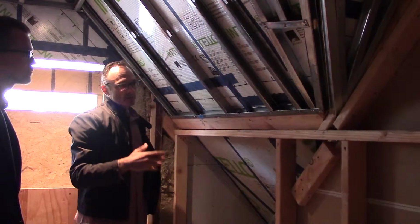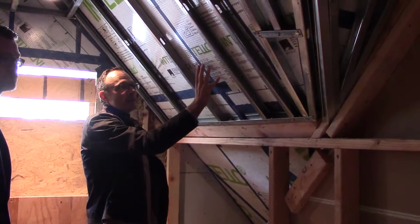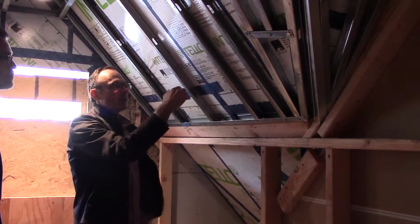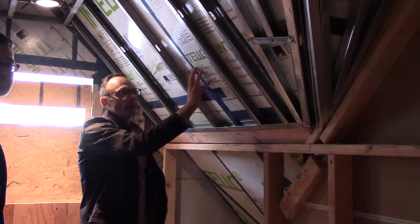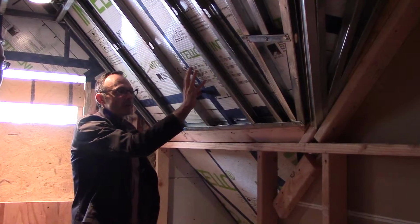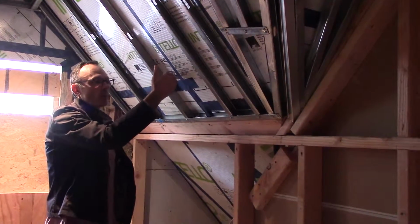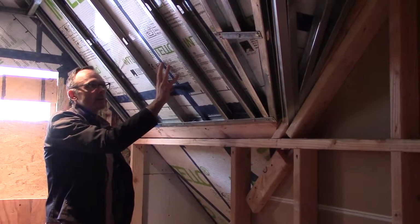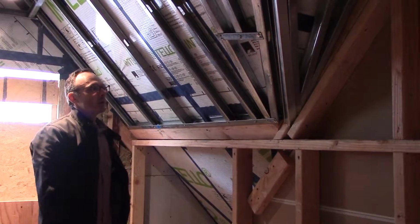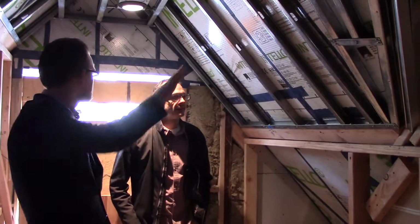And in terms of the question about having an air barrier in roof situations, with this amount of insulation, we like to use these types of membranes in terms of making sure that there is no dew point happening within the wall at any point. So this is a really good, safe option for roof situations. What kind of tape did you use to seal it all up with?